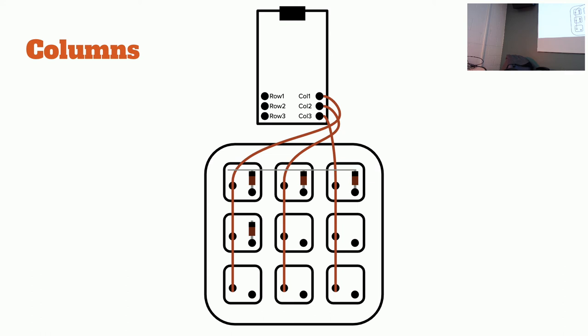So now, if you wanted to, try applying the iron to it and move it away a little bit. So you want to grab the wire, hold it stable. Okay. You want to do this? Yeah. I can already see some of the solder is being drawn on that. So you're essentially tinning the wire now. Oh, so that's not good? Or no, that's good? Yeah, that means solder's sticking to it. Okay. So now you'll take that, put it right there. Okay, that's not too bad. And then solder it down. Pretty cool. I like it. Yeah.